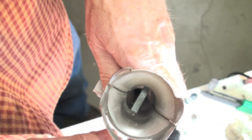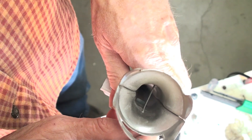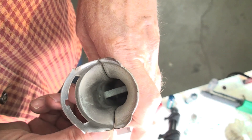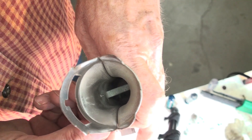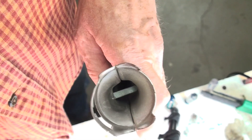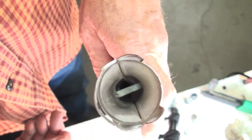This is what the burner looks like from the orifice. That little piece of sheet metal inside can be turned parallel with flow or sideways. Moving it back and forth is your primary air adjustment. When it's sideways, it slows the gas flow and doesn't draw as much primary air. These should be closed to get yellow tips, then adjusted back until the tips just disappear — that's how primary air is set.